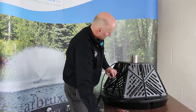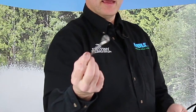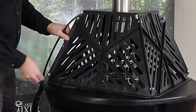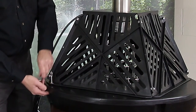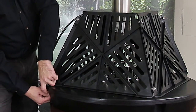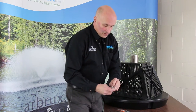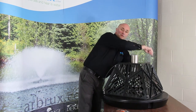Next step — we're going to fasten all this stuff down tight later — but first we're going to take these quarter-inch eye bolts and put a washer on there, grab another washer and nut, and in the bottom four corners you're just going to line up the holes in the intake screen with the float. Put that eye bolt through there — that's for fastening your mooring rope. In the previous video we showed how the mooring ropes went through the holes in the float, but now that's being used as a mounting point for this intake screen, so now we have the eye bolt for fastening the mooring ropes. We're going to do the same on the opposite side.